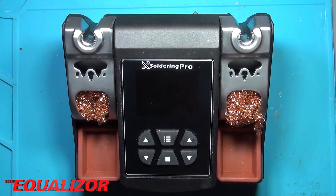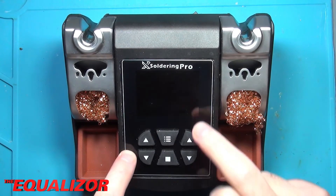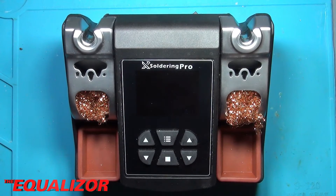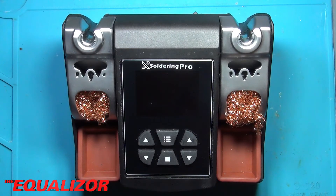Whilst I had the soldering station apart, I also took the time to glue this bezel down properly, and now it doesn't make any horrible creaking noises and doesn't move. I imagine I'm not going to be the only person with that particular problem with this station. One other thing I also discovered was that the firmware can definitely be updated in this soldering station — you can go to the manufacturer's website and download a tool which will update it, which I have done. Now that I have that new firmware, it does seem to have reduced the amount of times I get that tip error coming up. In fact, since I updated it about four days ago, it's only occurred once. One thing it hasn't done though is sorted out the discrepancy between what it reads for the tip temperature of the 210 and what the 210 tip temperature actually is.